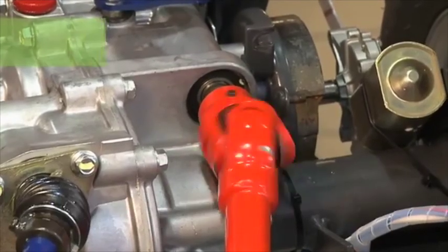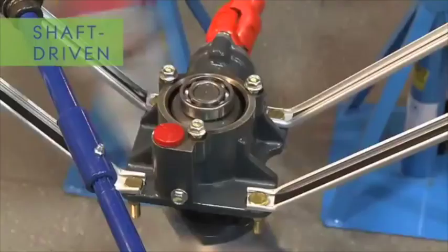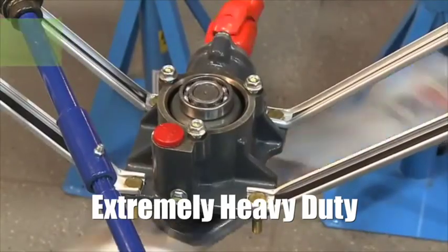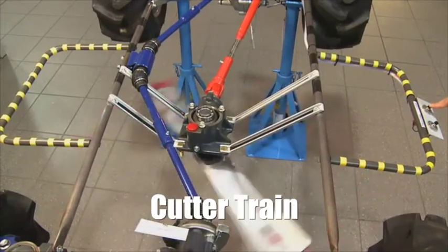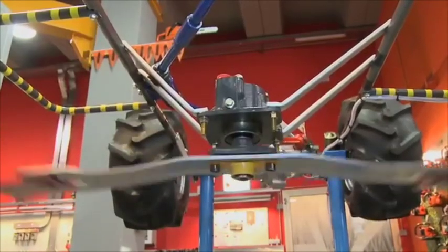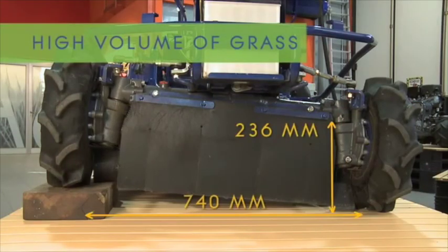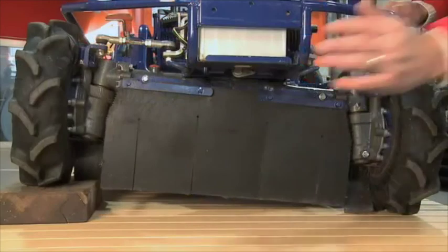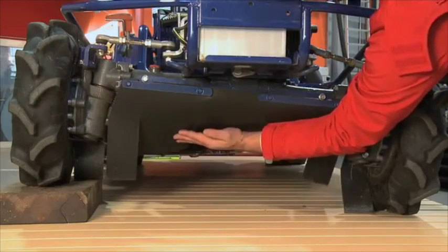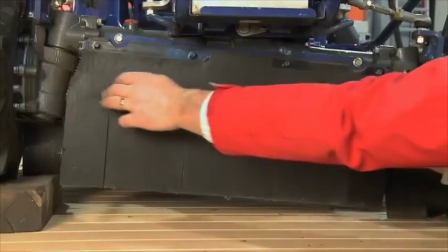All the engineering in the shaft system is extremely heavy duty. Large diameter shafts with solid splines, helical gears, large bearings with multiple seals are used throughout. The front of the mower deck is a large rubber flap that is capable of processing high volumes of material from grasses to 38mm saplings. As the material flows beneath the front axle, it is angled into the blades with a bean cutter style cutting action.